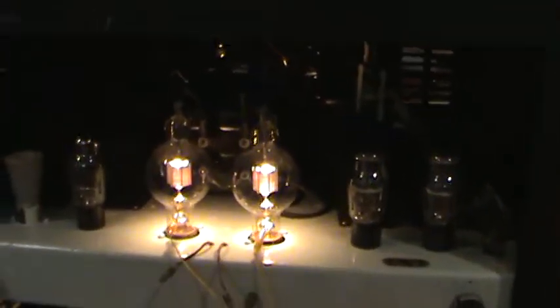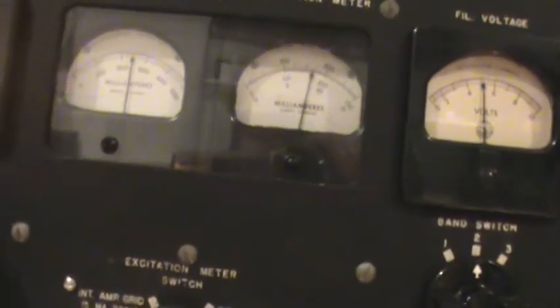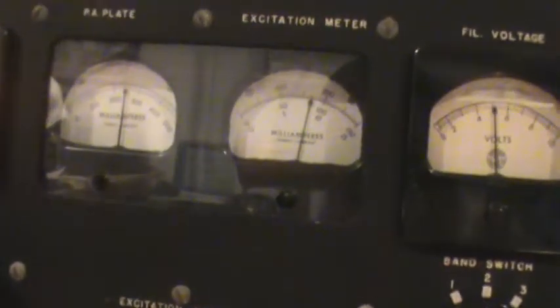There's a barely perceptible reddish glow on the 100THs. The mercury vapor tubes are glowing purple, and there's a very dull orange color on the 250TH. The transmitter is loaded nicely — I can probably increase the loading a little bit. At 250 mils, make sure it's dipped. That will give us a little bit more plate color on the 250TH in there.